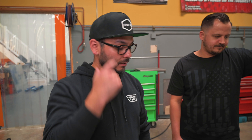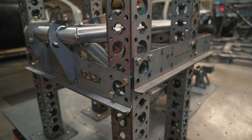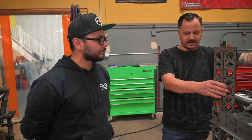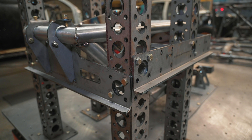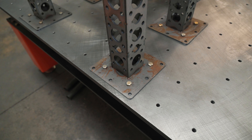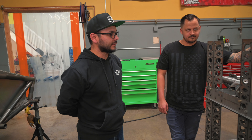With the bulkhead as the front end of the truck constrained into the table, we can start adding sub-assemblies like the cab, the floor, and the fuel cell cradle — constraining all of that and holding it in place exactly where it's going to land in the computer, so it's 100% accurate. Everything is drawn up: the table, the towers, every individual fixture plate. This isn't off-the-shelf — every fixture piece here is something we made for what we're doing, including the bolt pattern, all set up in-house.